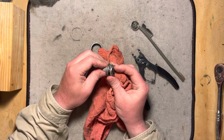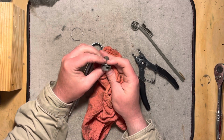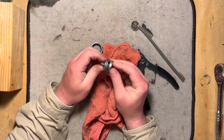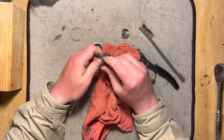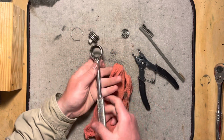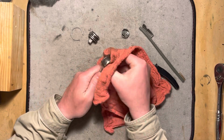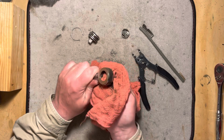But all it is you have this thing here, and there's a little spring-loaded detent down inside. Man, there's a lot of crud there. There's a spring-loaded detent down inside, and so when you flip this back and forth whenever you're changing the dial, it's just swinging these teeth out one side or out the other, and then it ratchets on these teeth inside the head here. So like I said, this is kind of the early design for a ratchet from 1934.